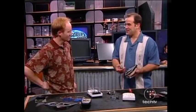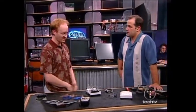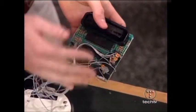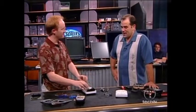What was the hardest part? The video. On the internet they would say things like, here's how to get composite video out of an old Atari, because they used to have those RF switches. But none of the things on the internet were accurate, so I had to modify what was available. The final solution was to use two potentiometers and a resistor for the video - you get the luma and the chroma, and then adjust it until it looks right. That's a nice little hack. It's on my site. How long did it take to build the first one? About two months - the video problem was probably about a month of stumping on my part.